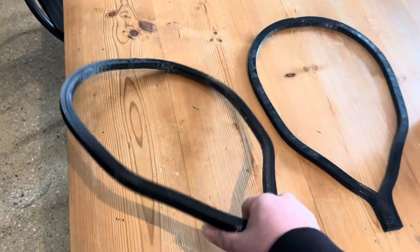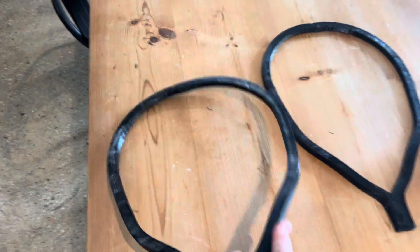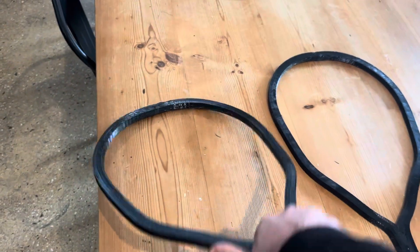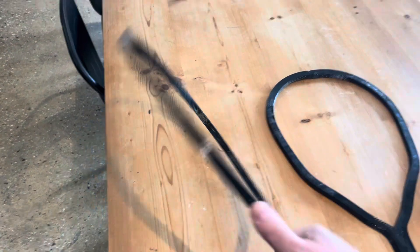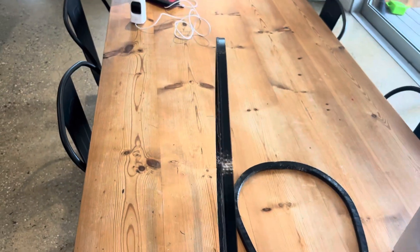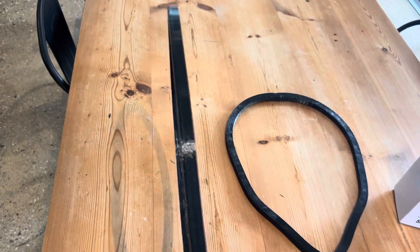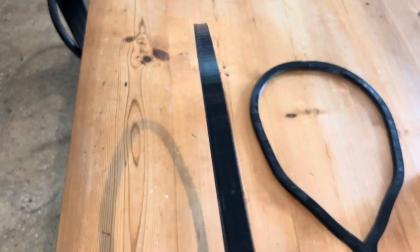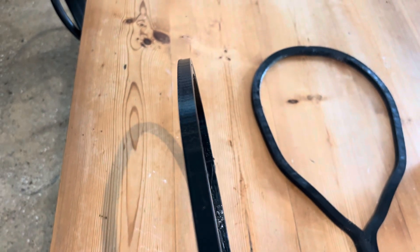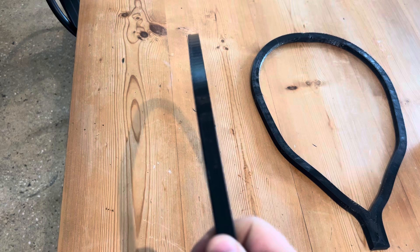This is the 72D part and it feels almost like a mechanically dumb version of PETG — slightly flexible. When I really put force on it, that's probably a couple of kilograms of weight through my arm, it almost returns to its standard position memory-wise. I didn't dry this before running it and the sidewall finish is much, much better.